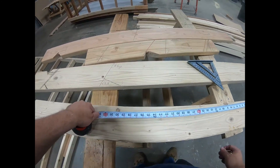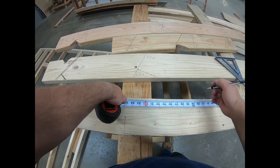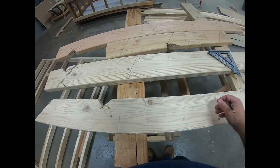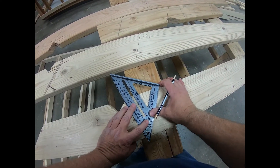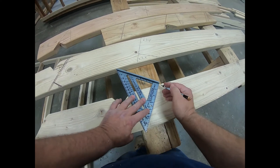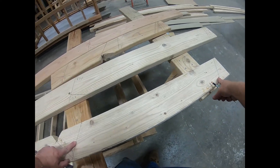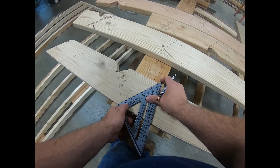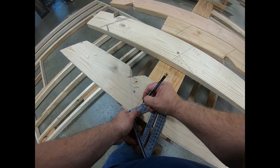To find the length of your rafter — let's say this is for a doghouse or something — I'm going to come down 32 inches. At that 32-inch mark I'm going to put my common 8, so this line and the line up at the top should be parallel. Then I'm going to measure up from the bottom about an inch and seven eighths.